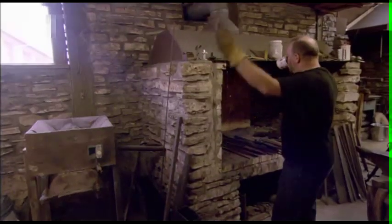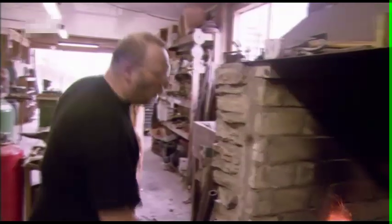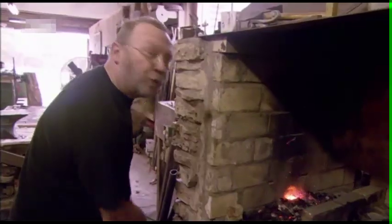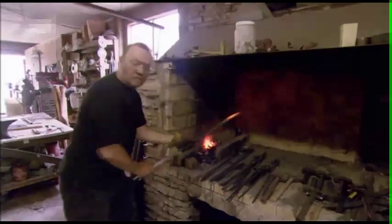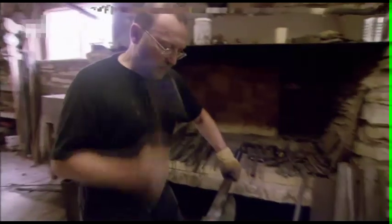The changing colour of the surface of the metal tells Dan what's happening inside the blade. One of the things that's key in this process is the chemistry of the flame — we are controlling the chemistry of the steel through the chemistry of the flame. When the blade reaches this semi-fluid state, Dan is able to work on the steel using traditional blacksmith tools. But Dan isn't just hammering the blade into shape; he's deliberately denting the edge.